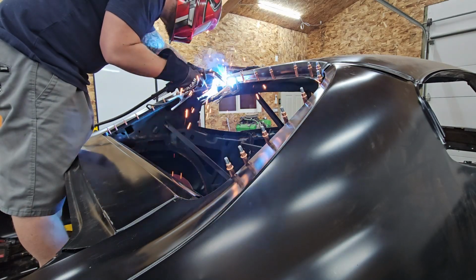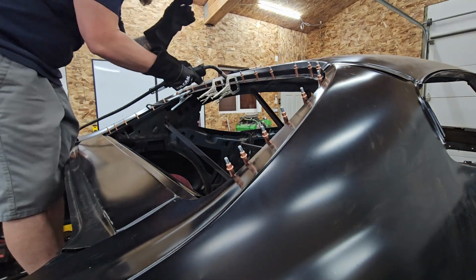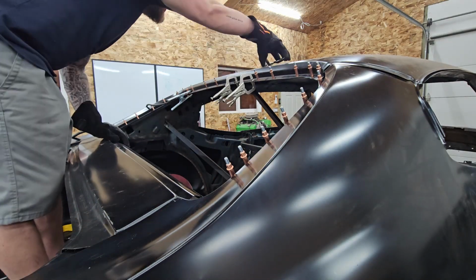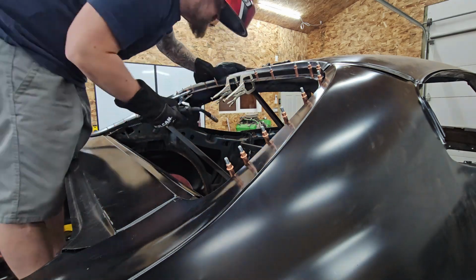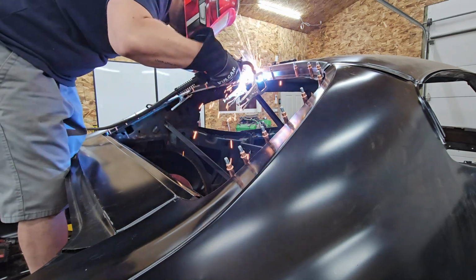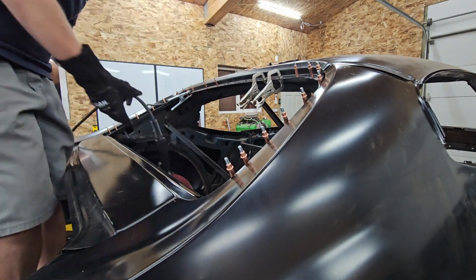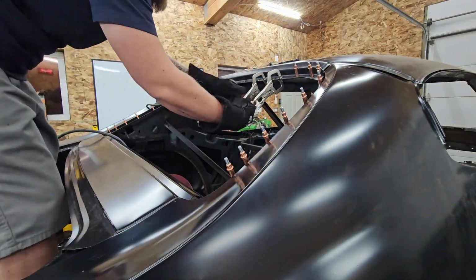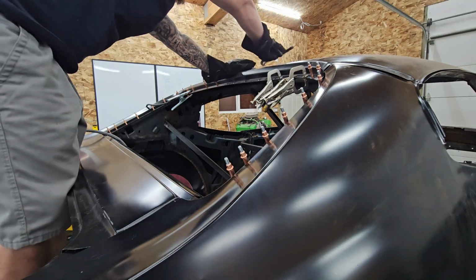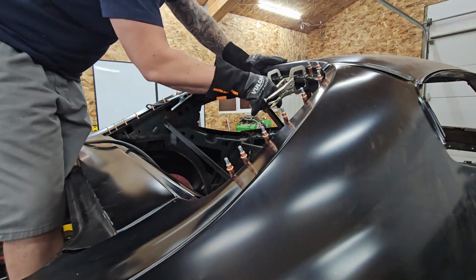Now, for the long process of welding, I learned a lot during this process because, well, not overly happy with the way I did it. Turned out fine, should be rigid, it's probably honestly stronger than it ever was from the factory. And again, I'm going to go through and put new, fresh strips of sheet metal in it to make the custom flush mount opening for the rear window. So I'll get to hide all of this anyways, and I got a lot of cleanup work, right? So it's going to be a while before I'm doing finishing work. This is all just tacking it together so it's a solid car. And what I did on this one that I don't like, which you have to fill the cleco holes.